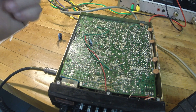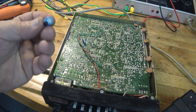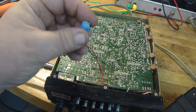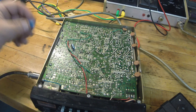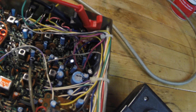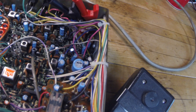Lo and behold, I was getting audio output but no signal coming in. I hit one side of it — what's weird is if this had gone to short it would probably have been easier to trace, might have created a hum. But this was an open capacitor — it looks fine, but it's totally open, basically two prongs with air in between, so it wasn't passing any signal through at all. The culprit was capacitor C162, a 470 microfarad 16V capacitor — open, not shorted, which is unusual.